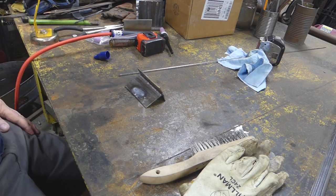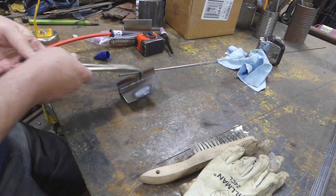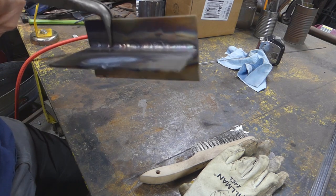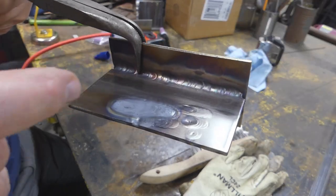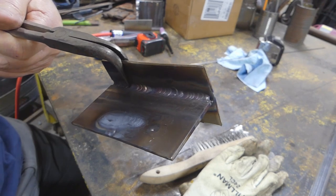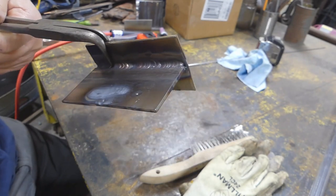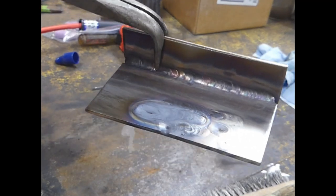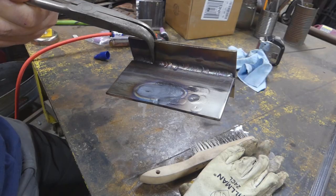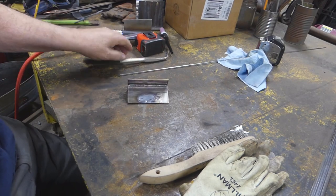I don't like how it's looking. I haven't done any welding in over a year since I took my TIG welding class. It's got that kind of rough, sugary look to it. I think I need more argon. I'd like to get a bigger cup, but this is a number seven — that's the largest that came in the kit. If you know what's going on, make a comment below. That's with a filler rod and it just doesn't look that good. I didn't clean my filler rod because I don't have any acetone — I've got to get some.